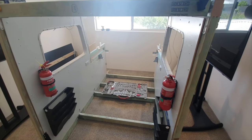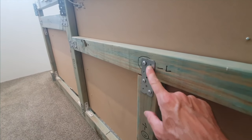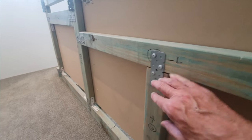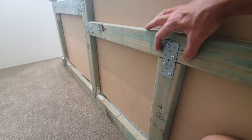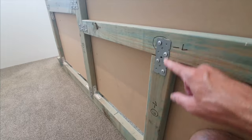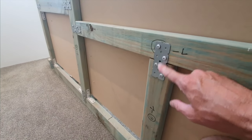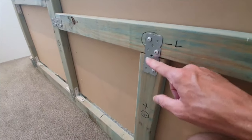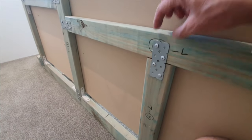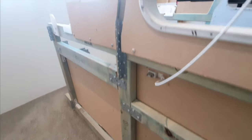I forgot to mention a couple of other bits. I've also got these small steel flat plates just to tie the frame joints together. You could notch the timbers if you were doing it really professionally, but I just used these little plates screwed either side to hold the frame together. The beauty of these is they've got multiple holes and come in different lengths, which was handy.